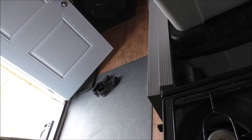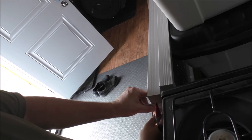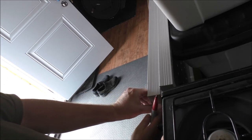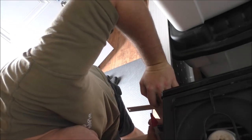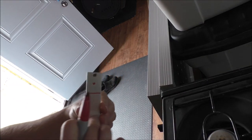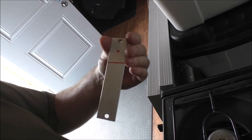So I'm gonna mark this. Keeping that surface area flush to the top, I'll go back about here, and the hole that I'm gonna send the screw through I'll mark that as well - around here - so I don't damage the cells whatsoever. If I mark this and do a bend and try it, this will be my test piece. I'm gonna go bend this, try it, and if it's good I'll make a template, then we'll cut off the excess and go from there. I'm gonna put that into a break and bend it 90 degrees.